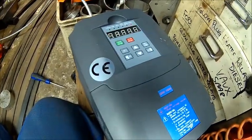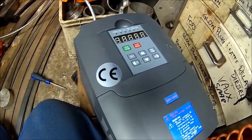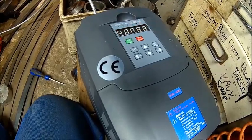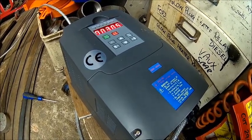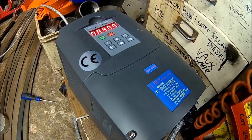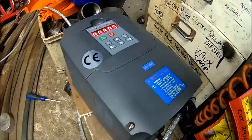I deliberately used a bigger inverter - the motor is only 1.1 kilowatt. But you can't set the motor current, so this thing runs full current with no way of protecting the motor except for thermal protection inline somewhere. This is rubbish honestly. It doesn't say a make on it. This thing is probably the biggest disappointment I've ever seen - it's got only 35 parameters and the only thing you can set is the maximum motor frequency. No current, no voltage, nothing. You get what you pay for, it's a piece of crap.